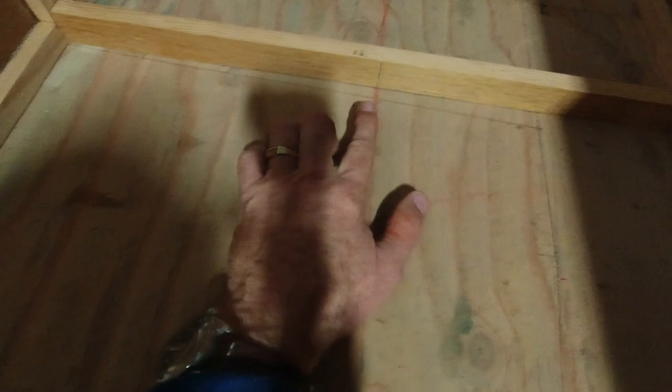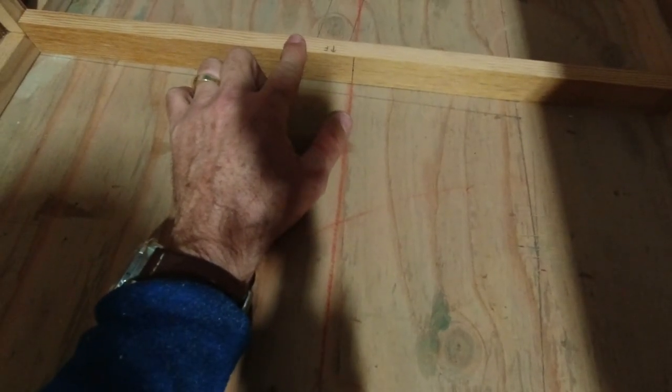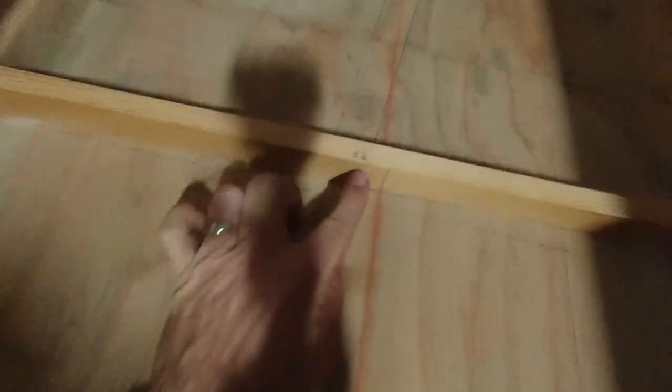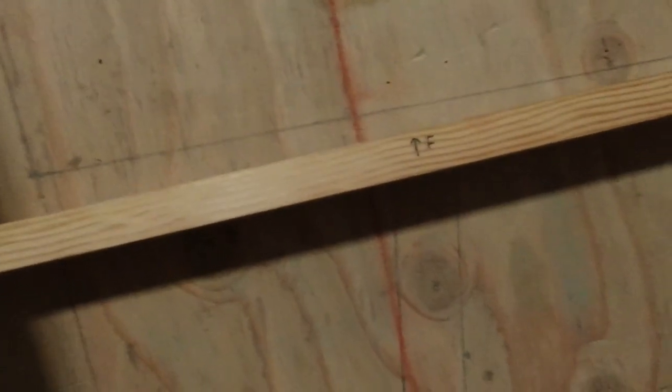And then I was just testing my spar carry through the front piece right there. I've got a line drawn here. It's a piece of RS10. It's actually got a 2-degree cut on it that I made on the bandsaw earlier, and the low part of that 2-degree cut goes to the front, so I've got a little mark. Can't quite see that. Go around the side here. I've got a little mark there that basically shows me to keep that to the front.